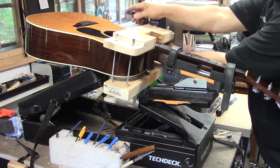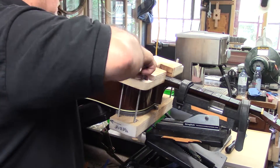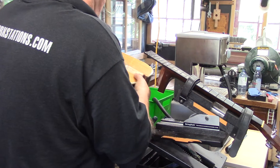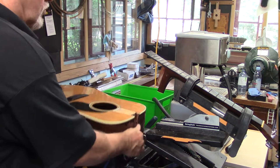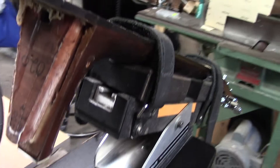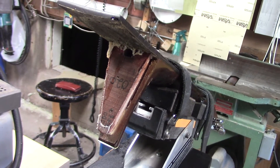That's it, she's done. This came off super clean — there's no blushing whatsoever anywhere on the finish. The dovetail came out super clean as well. You can see they had a healthy supply of glue in there. While that glue is still warm I'm going to clean most of it up.